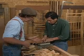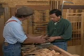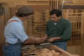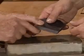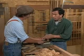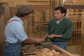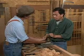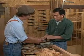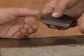Wow. Now, John, what I would do is I'd get out to a burr. I'm sorry, just bad sharpening habits. I will let a wire edge come out, and then I'll say, okay, I'm going to just kind of stroke that off. But that's the wrong thing to do, you say. Right. What I do on these tools is we just sharpen off the burr. If you fold that burr back and forth, it's a form of work hardening. And when it rips off, when it does finally break, it creates a very jagged finish. And also, you've changed the working properties of that steel on the end, so it's not going to be what you really want. So ideally, you're just sharpening that off. You're cutting on one face and then cutting on the other, and you get that real smooth final finish.